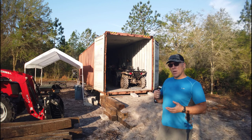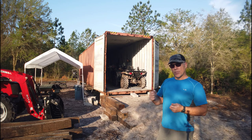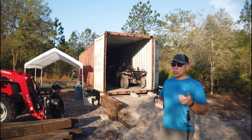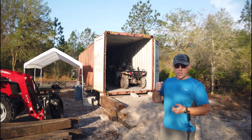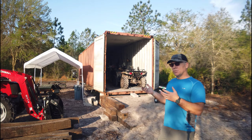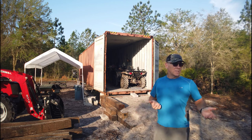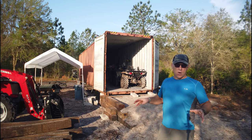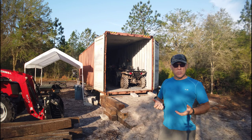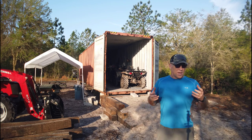I got a metal saw — used some points on Amazon and got a dedicated metal saw. I tried to use my compound miter saw, but it's got some plastic parts, and after a while if you're using a cutting wheel on there, those parts can get quite hot. The rebar glows red hot if you don't let it cool down, and those saws just aren't built for that. So I got a dedicated all-metal saw — metal deck, metal guards, metal everything — with a 14-inch blade.